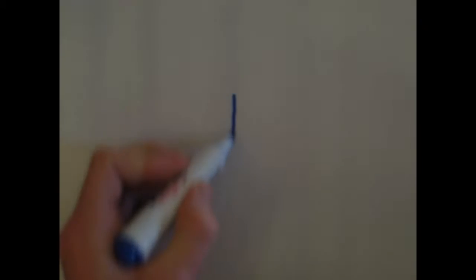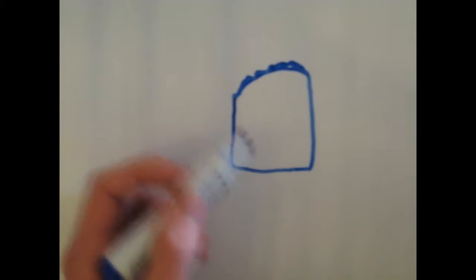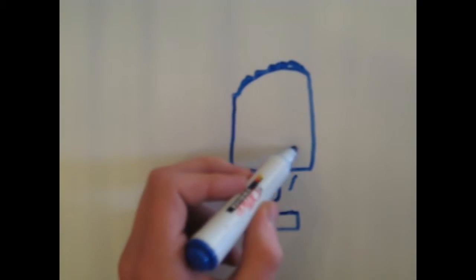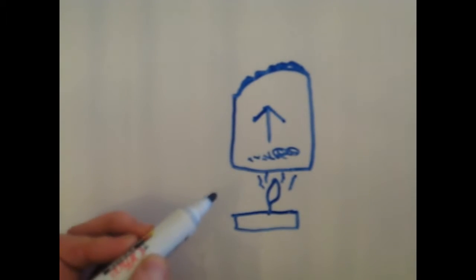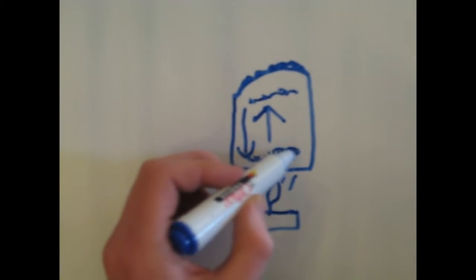The Stirling engine works by taking advantage of two basic physical properties of a gas. The first being that hot air rises, so as the air down the bottom of the aluminium can is heated up by the candle or flame, the hot air rises to the top where it is cooled down, and then the cool air sinks back down to the bottom to be heated back up again, and the cycle continues.